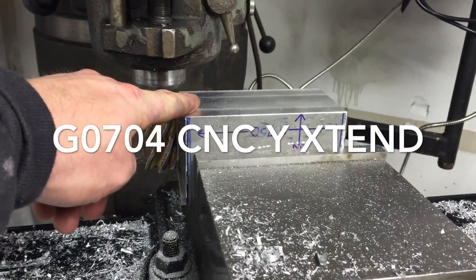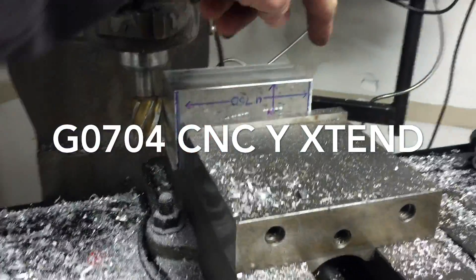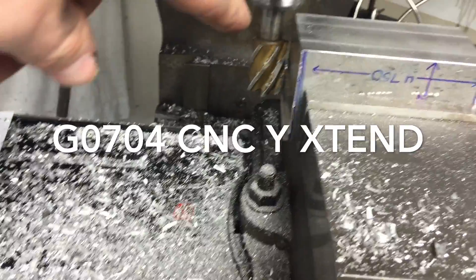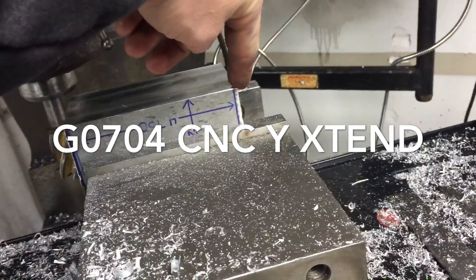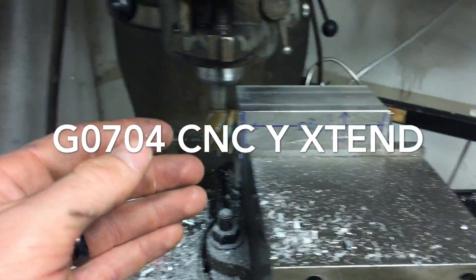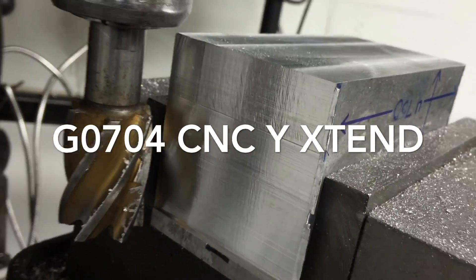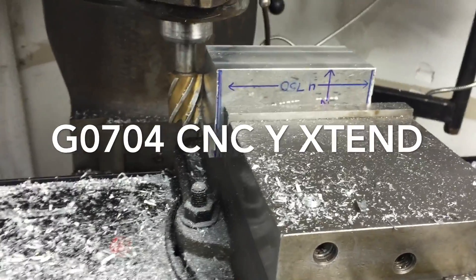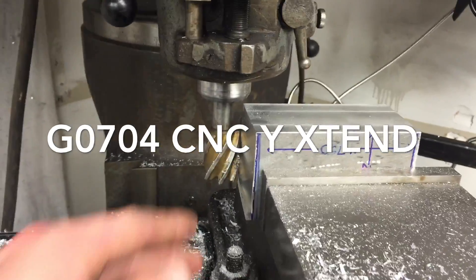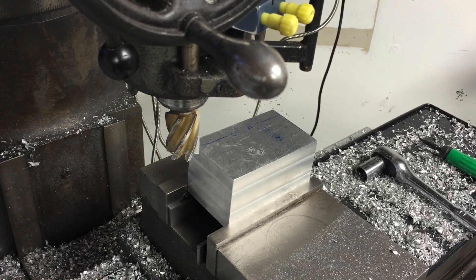If you get to this position, you could flop it over on the other side and attack it from there, but then you have to reset everything. I decided to do it like this, and when I go to take the remainder off the other end — because this has been cut with a bandsaw — I'll be able to stand this up and mill that straight off the other side. I'll put this vertical in the vise, clean that other side up, then flip it over one more time and do the finished pass on this side. The finish isn't perfect, but this is just getting me close, and the actual dimension isn't going to be too big a deal — the only crucial thing on this side will be the finish for aesthetics.